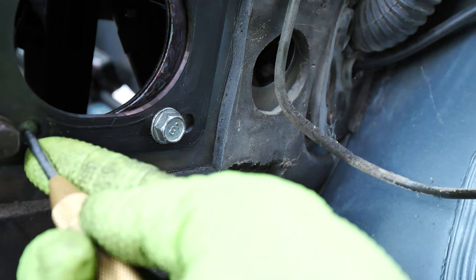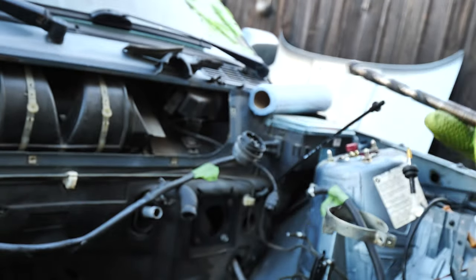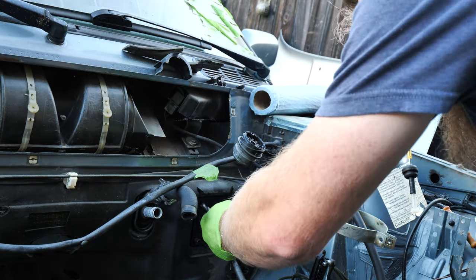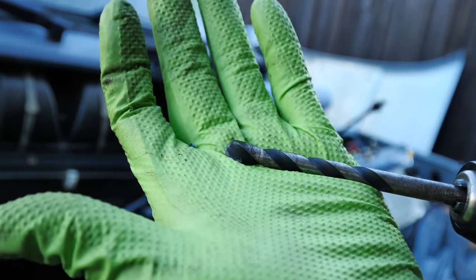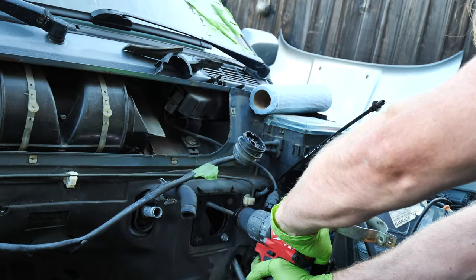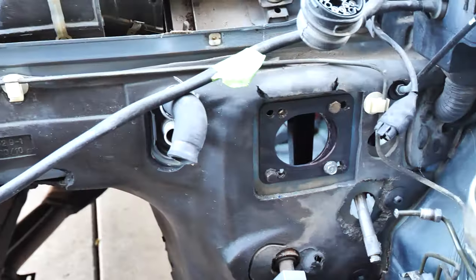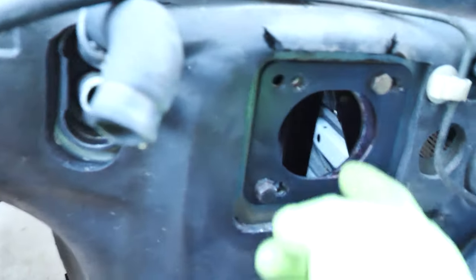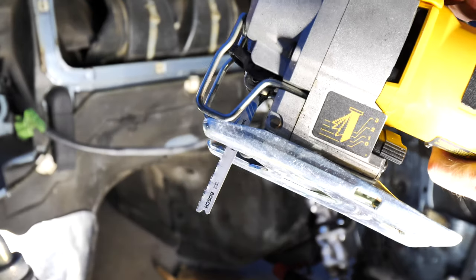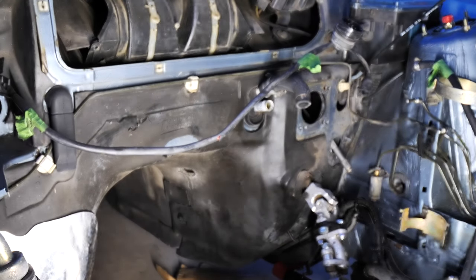Center punch all these holes. As far as the drill bit goes it is 11/32nds - I don't know the metric equivalent but it's basically the same size as the old holes. I'm using these Rodman brand bits that have kind of a filing action - I tend to like these for metal. Got all four of those holes drilled. Now I just need to notch this area right here. I was thinking about doing that with a jigsaw - I went and bought a new blade. I'm going to try to cut that little area out.